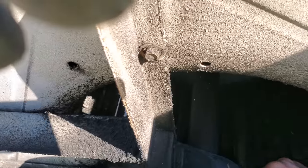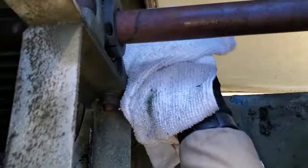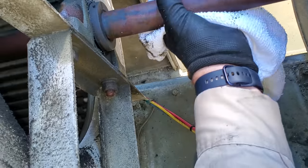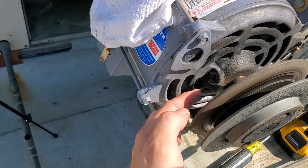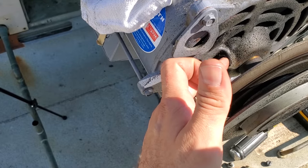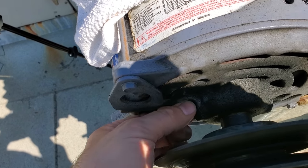We'll remove the grease from the zerk fitting down in there, and it looks like these seals are starting to go bad. Remove the grease so there's not a big mound of it. Same thing back in here — get the grease all cleaned off. These blower wheels are dirty; they need to be pulled out and thoroughly cleaned. We're going to grease the motor bearings too. This one works out nice because we have a drain — I can put a zerk fitting right here and we have a drain out the other side so we're not just packing it full of useless grease. I temporarily borrowed the zerk fitting from the bearing, put it on here, and greased these guys up on both sides. Hope that solves that problem too.